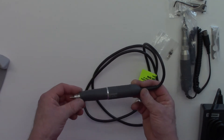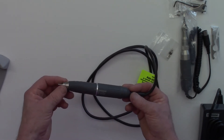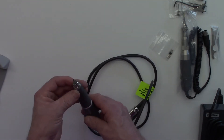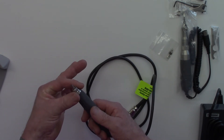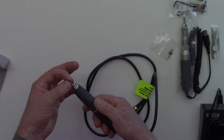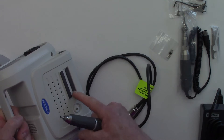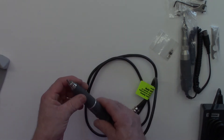What we have here is the brushless rotary handpiece, which connects into the back of the unit. It runs virtually vibration-free with a speed range of 1,000 up to 50,000 RPM. What we have inserted here is what we call a dummy bar — it's put in just for transport and storage. We don't want to leave the collet empty because it can collapse under pressure over time, damaging the collet when you later fit a burr. This goes in as a safety measure; I'd also recommend removing your burrs for transportation and inserting the dummy bar. The magnetic plates on the side of the unit are a good place to store burrs as well.